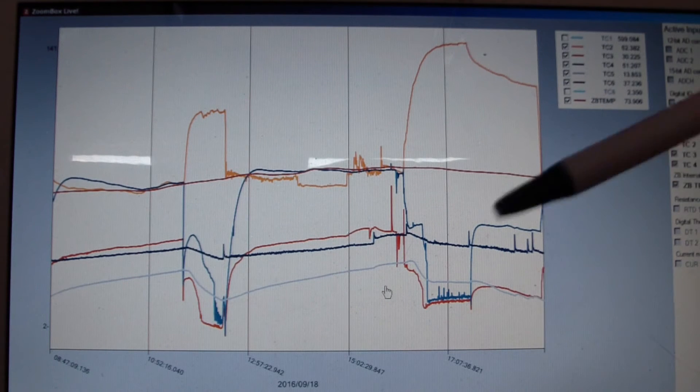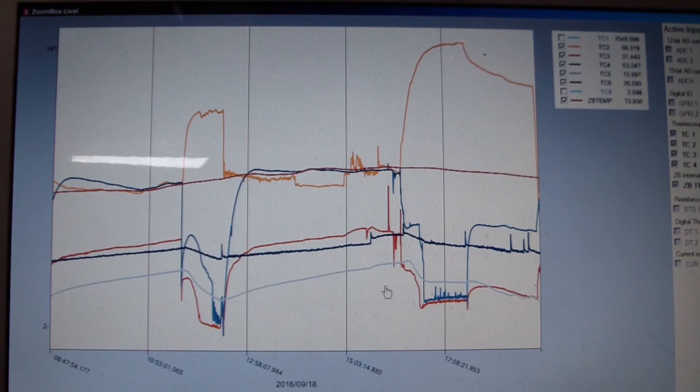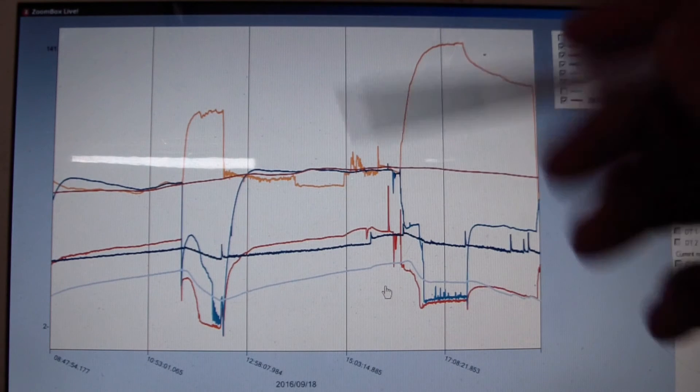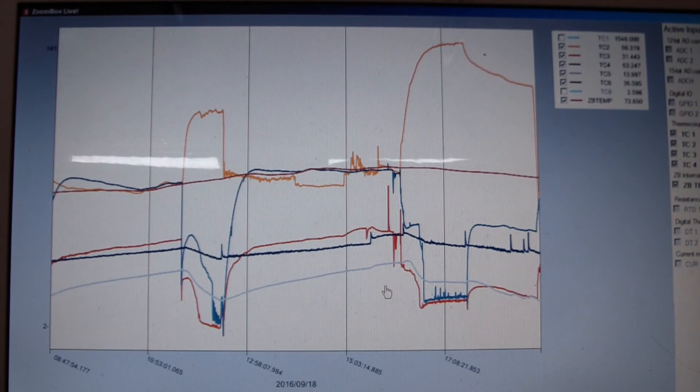After venting, low-side and high-side pressure both dropped. Overall flow rate decreased slightly, but head pressure dropped so much that current draw on the compressor declined significantly. Discharge pressure fell, compressor wasn't doing as much work, discharge superheat dropped significantly. Immediately I noticed the paraffin temperature stopped rising, then slowly started to decline — the thermosyphon was actually starting to keep up, at least bringing it to a slightly lower temperature.